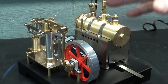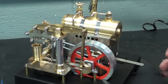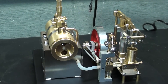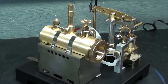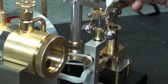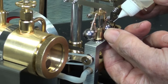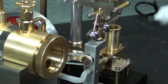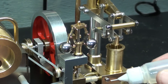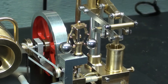Remember that once you start running this, there'll be steam and water all over these different parts that will wash away the oil, and you do not want to run it dry. And then a couple drops here in the cylinder, which I have done before. I don't really know if these tiny little linkages in the governor need it, but I'll do it anyway — there are just a lot of little pivot points here. A couple drops on the gear couldn't hurt. And the valve — I think I got everything. I'll go back off camera and oil the rest of these linkages.